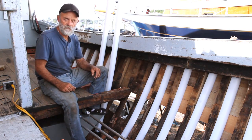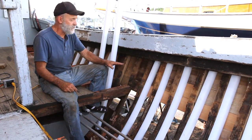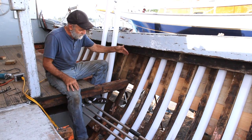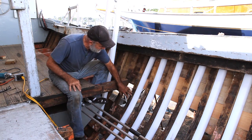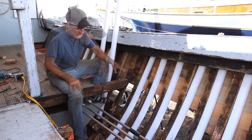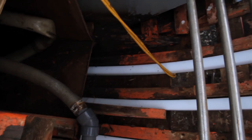I'm on board the fishing vessel Finest Kind this morning. She's had a problem here on the main deck in the area where they do most of their fishing — water leaking over the gunnel down through. The deck has come loose from the sides of the boat and the framing in this area is not good enough to put it back on. So what we've decided to do is sister frame this entire side, and rather than using wood, we're using plastic.